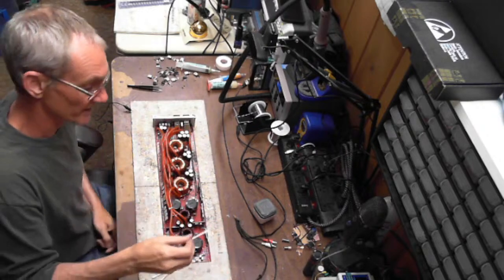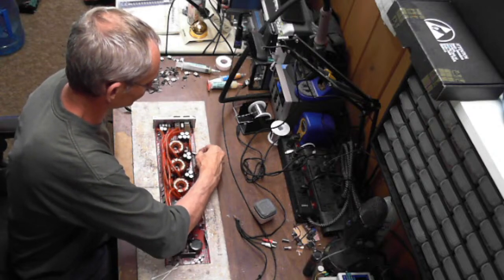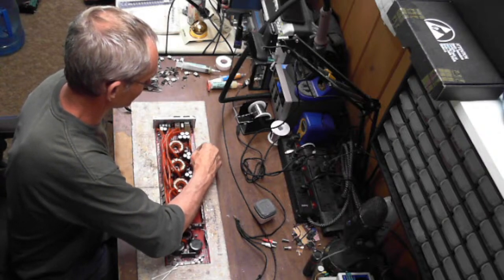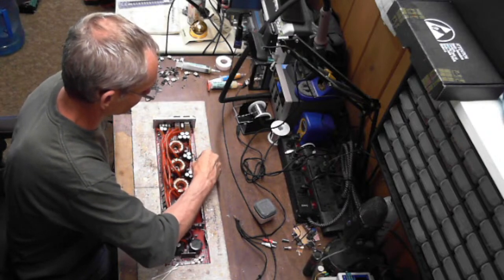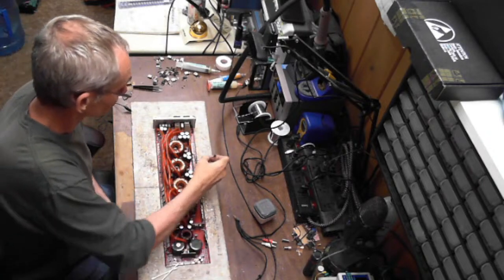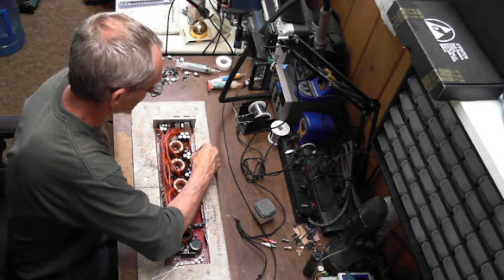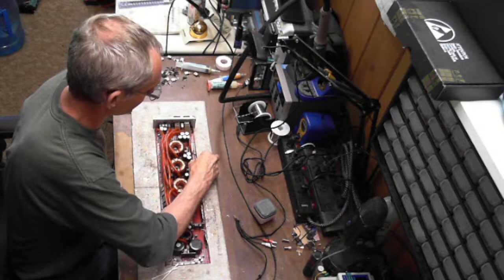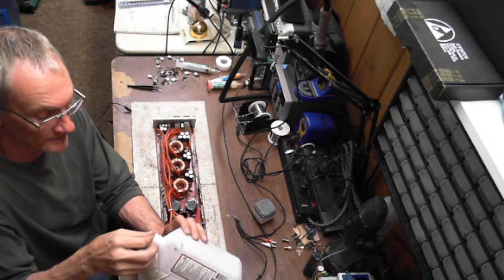If transistors are old but never used, are they still good as new, or do they age in the packaging? Oh, transistors? Oh no, they're good. I have some new old stock transistors here that are old enough where they've actually got a little, I don't want to say discolored, but you can tell by the metal that they've aged nicely. Transistors really don't age, because you've got to remember they're solid state. They're not like the vacuum tubes that have been used in the past. They really don't wear out per se. I mean, you can heat cycle them a million times and they might wear out, but transistors that haven't been installed, I would not worry about using them.